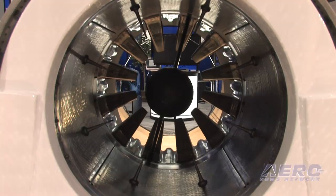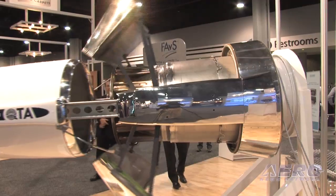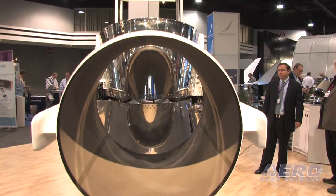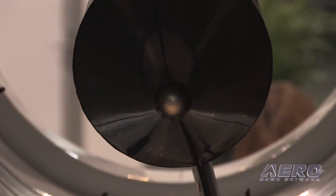In the front of the engine, all the newer engines — anything built predominantly after 1990 — is a high bypass fan motor. The Spey, which we're hushkitting on the G2 and G3, is a low bypass fan motor. So it doesn't have a lot of bypass air coming around the engine itself and mixing before it exhausts.